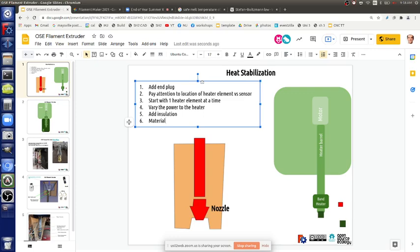Whichever that is, PET is actually highly hygroscopic, meaning it absorbs a lot of moisture, so it'll be harder to work with. And maybe that's the thing that's preventing us from succeeding. Like maybe there's bubbles here and we're bubbling stuff and not really filling the nozzle. The goal is to fill that whole nozzle with material. And it has to flow down, has to have enough residence time in the nozzle so you get the whole tube filled, so you get continuity.